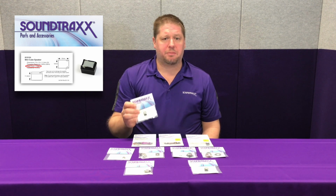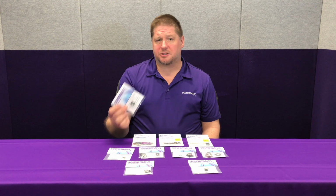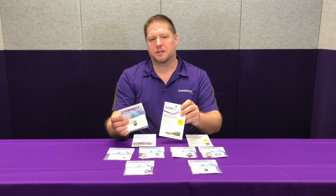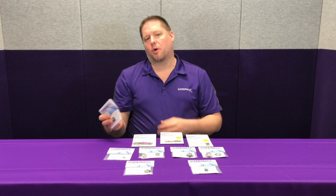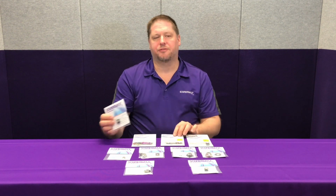These have become very popular in recent years because of their small size and compactness. But because they're 0.7 watts, we don't want to put 2 watts of power through it. So what do we do? We take a second one, and we mount the 2 speakers in series, and then now you have 1.4 watts, which is well within the tolerances of the 2-watt amplifier.